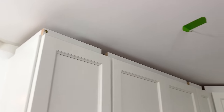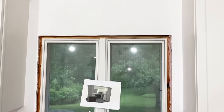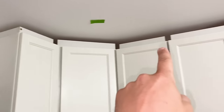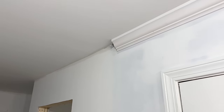I'm going to start over in this corner, work my way around, and then dive it into the wall. I think I'm going to leave this piece out for now until I figure out what to do here. I can always add a piece afterwards with two copes, and then I'll continue it right here, come around into the refrigerator panel, wrap it around here, and then zoom it right down the hallway. I left the refrigerator panel a quarter inch away from this wall because that's what I want that bottom reveal to be. So this crown will actually be totally even with this wall, and then I can wrap it around this hallway, remodeling the hallway at the same time, and then match it up to this piece of crown here.